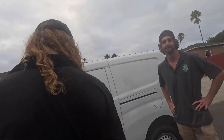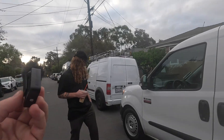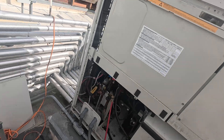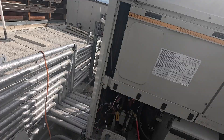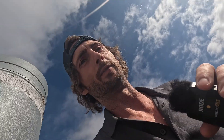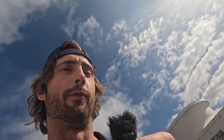Look who's back! Mic check, mic check. The long-awaited return of Johnny. We have a mic for the GoPro now, so you gotta make sure this is on. We are working on this VRF system, this Mitsubishi. This guy holds 26 pounds, about. We found a leak down by the ball joint area before the branch box. We're recovering all the refrigerant, and we're gonna be reusing it after our services today.